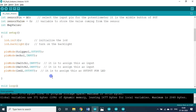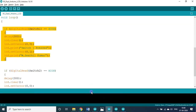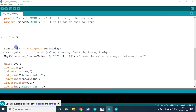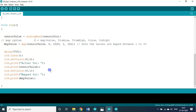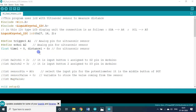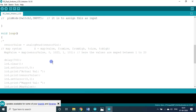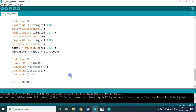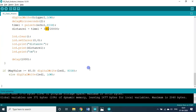This is how I wrote the program — I can say it is my own. From day 6 I copied the switch block using Ctrl+C and Ctrl+V. Then from day 7 we saw about analog value finding, varying the resistor — 10-bit, 0 to 1023 — and the mapped value 0 to 101. I included that too. Then from day 8 we used the ultrasonic sensor, so I copied that block and pasted it — distance, time equal to 340 meters per second, the conversions.